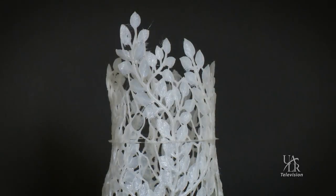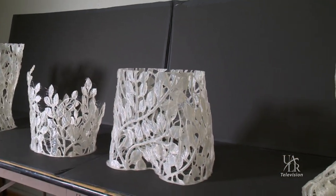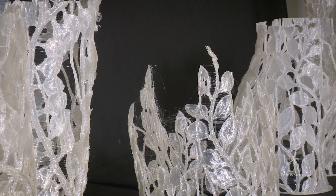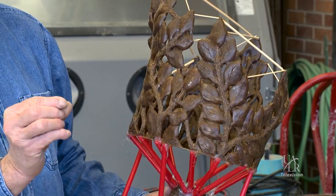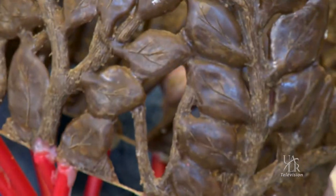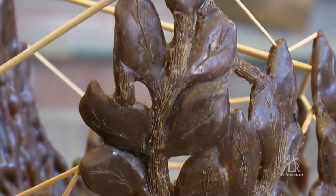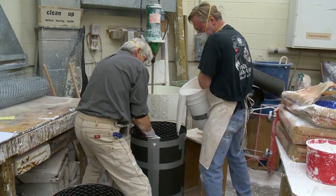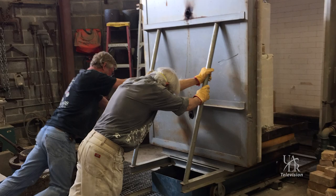You can see all the leaves and the vines, but it's what they call a rough 3D print. It's dipped in wax carefully, which puts a thin sixteenth-of-an-inch thick wax on it, and then I model the surface — putting texture for the vines and a little bit of veins in the leaves to give it more life. The new technology allows me to create this really thin, ethereal form in plastic and wax and be able to cast it in bronze. Eventually we'll invest it in a plaster and sand mold that'll weigh about 150 pounds, then put that mold into a kiln and melt out all the wax.